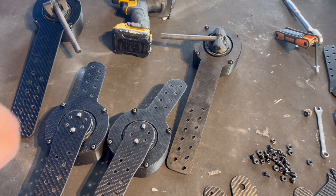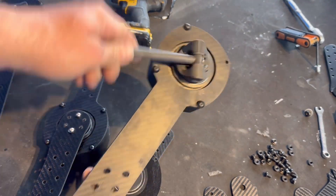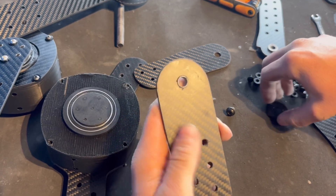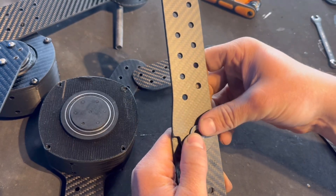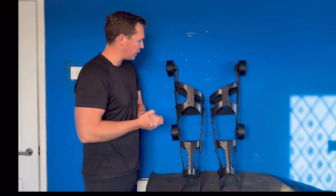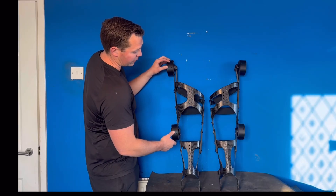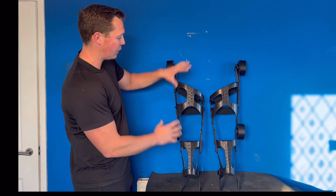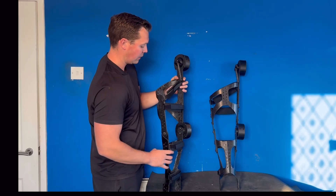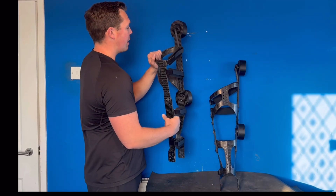After a quick sigh of disappointment and frustration, I moved on to the other carbon fiber parts — getting the outer knee hinge brackets built up with the mock-up elastic actuators fitted, then getting the slotting hinging pelvis points fitted onto the actuators and onto the carbon fiber brackets. Then the slimline inner knee hinges were built up with the rubbing washer, sleeve shoulder washers, and sleeve nuts, all bolted together nicely. Here we have them built up and complete. The mock-up elastic actuators are on, the hip inserts are mounted, the strap is in the back, and you can see the leg lock function working — with a good degree of movement and the ability to squat to parallel.